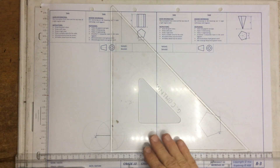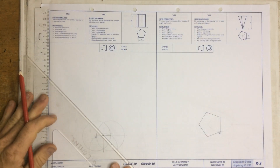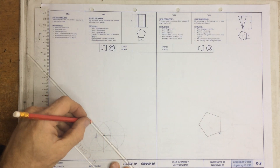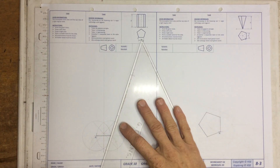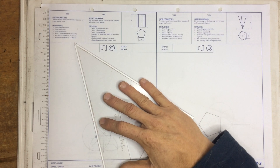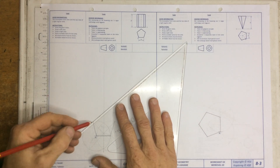I can draw a perpendicular bisector over here, and a perpendicular bisector coming up here. I can now take my lines going from that intersection of the circles through where the bisector cuts the arc, going up to that point, from that intersection up through that arc where the perpendicular bisector touches that circle. I get that 72 degree angle for my pentagon, and that same 72 degree angle for the pentagonal side. Now I can take that same 24 millimeters, mark that off, and I have a nicely constructed pentagon.